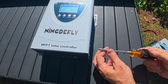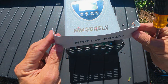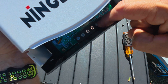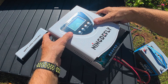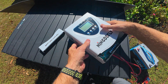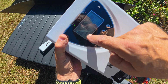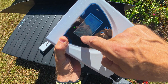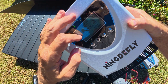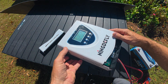I'm going to show y'all real quick how to wire up the solar controller. Take that cover off — it just pulls right off — and you can see down in there. I went ahead and got the positive and the negative connected. As soon as I did that, you can see the status is on standby and we have 35.3 volts coming in. Going out is zero for now.